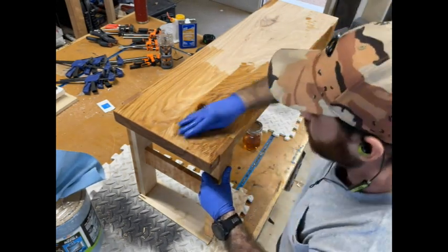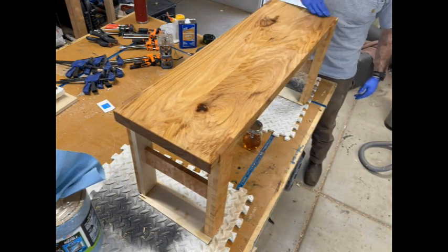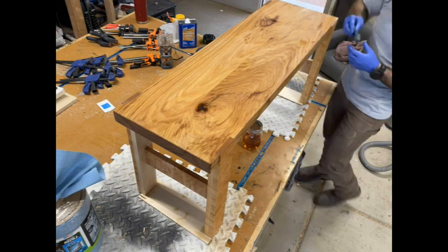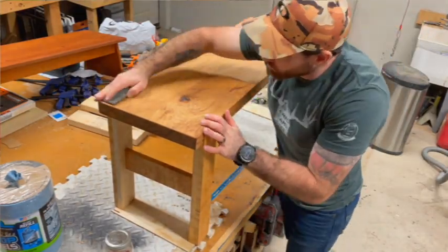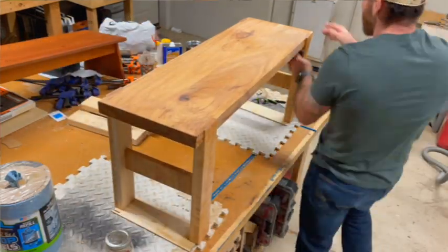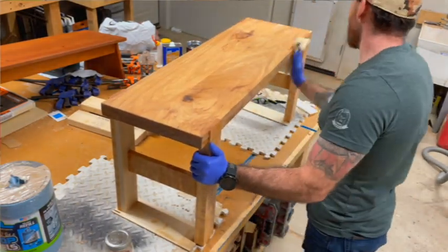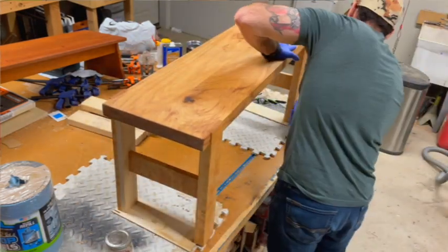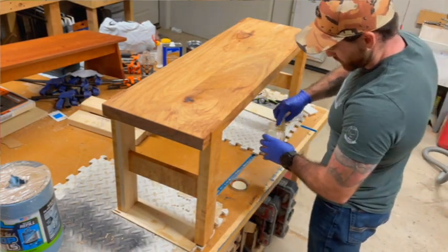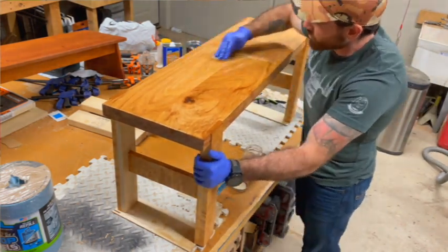Oh man, I love this amber tone. This hickory was really brown and that was one of the reasons why I chose this piece — I wanted something just a little different from your average hickory, and it really came out nice. And here you can see me wearing my extra shmedium — just came back from peacocking at my daughter's gymnastics gym. Hitting it with a gray Scotch-Brite to clean up some of the dust nibs and high spots, then rubbing it down with a tack cloth, and now taking a white Scotch-Brite and putting on the third and final coat.